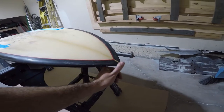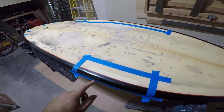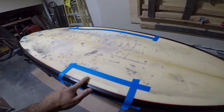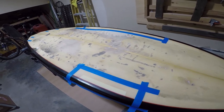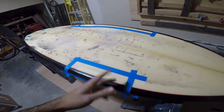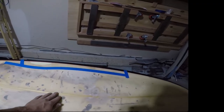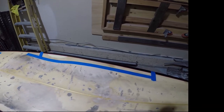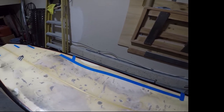Just about to the laminating stage. So that means all the filler's done, all the patches cut out, filled, smooth, sanded. I sanded out some of the rough edges. We got our first patch here. Painted the whole rail black to match. Tried the yellow tint just to get it a little closer. So I got this taped off cause I'm going to put the glass in. I want to make sure it doesn't get too crazy — I don't really know what's under here, but it looks solid and closed up, watertight, so that's fine.